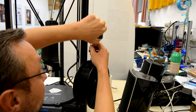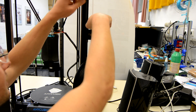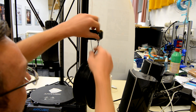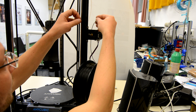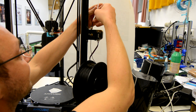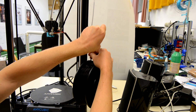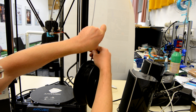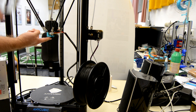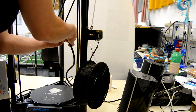Push, push, push, push. It's easier said than done. Let's just unscrew that — I'm just trying because you're too weak. Such a pain. Yes, I'm cheating. A real man would have done it the proper way, by pushing like hell. Of course. And we put it back in there and now we can slide it all the way through. Looks good. It doesn't go any further — we've reached the heating block. Now we'll heat up everything and see if we can extrude properly. We remove the leveling probe since we've done that and we're fine.